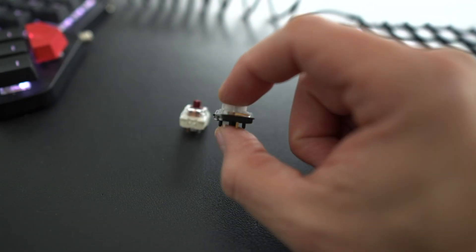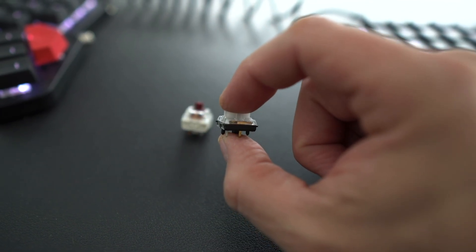Because you build it with hot swap sockets it means that you can swap the switches out. That doesn't mean you can take the MX's out and put choc switches in — that would mean putting a different hot swap socket on each of the points, which is a big no-no. But within the bounds of either MX or choc you can swap the switches out. So I've got clicky choc switches in this one but I could swap those out for a linear choc switch if I wanted to.